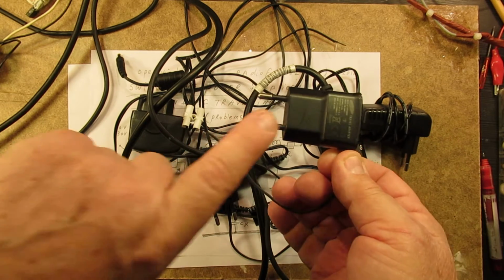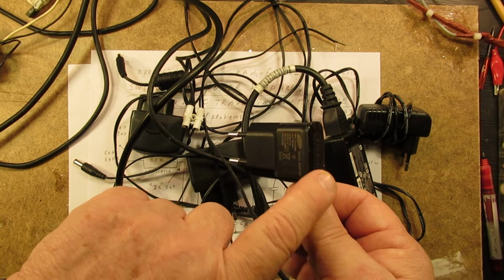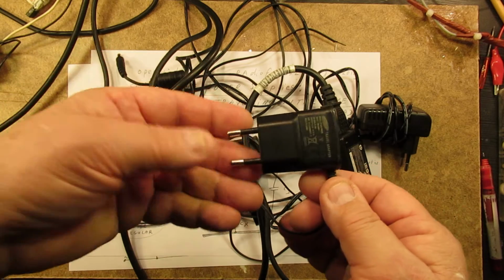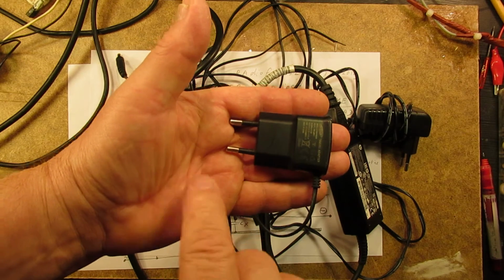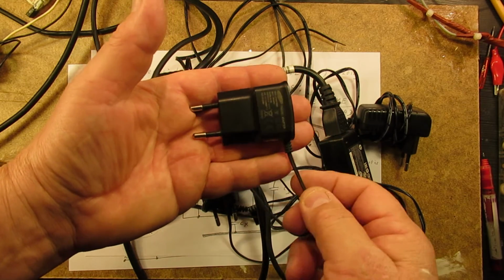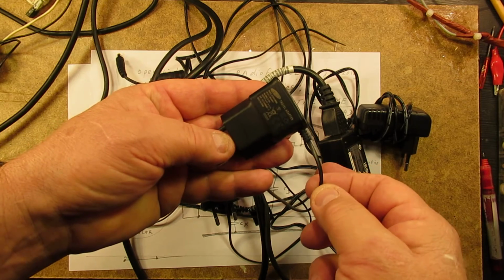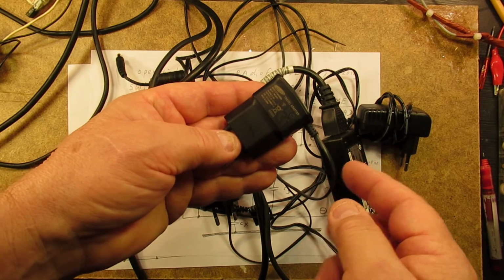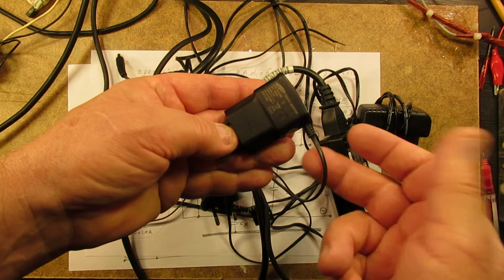The only thing that we know is that AC gets in and DC gets out, and for many simple computer things it's 4.5 volts or 5 volts anyway. So what happens inside here? To know what happens inside, you have to open it. Then take your oscilloscope and measure what happens, and measure at the output with a dummy load that gives a nominal voltage that the circuit can give. Say it's 500 milliampere at 5 volts, and with Ohm's law you can calculate when that current flows. Connect an ammeter in the positive lead.